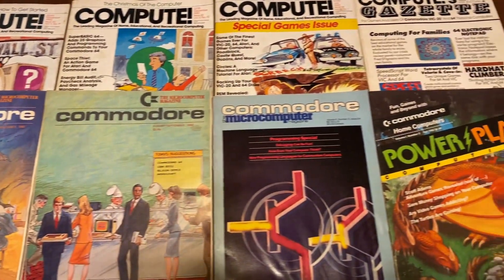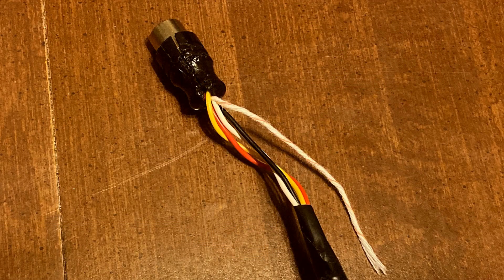Upon power-up, however, it booted and ran for about 30 seconds, then the power indicator began to fade away. I spent some time troubleshooting voltages, checking continuity on the wires from the power connector back into the power supply, and making the power cable ugly in the process.